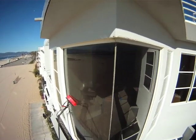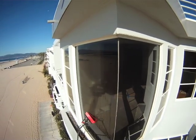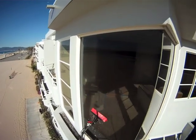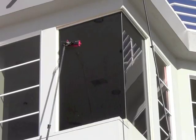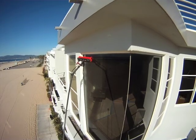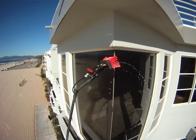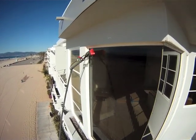The tops and edges are your Achilles heel on some jobs. When you first clean with waterfed you'll find there's a break-in period — the first couple of times you do it might take a little extra work getting the edges cleaned out of all the dirt. But then when you come back you'll find it's a quick, easy process. Now that we have a dry area just below the top edge of the glass, you can safely rinse across the top and you know you've got nothing but pure water left on the glass.